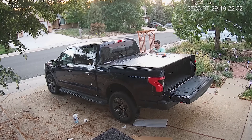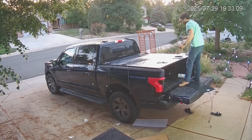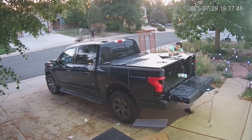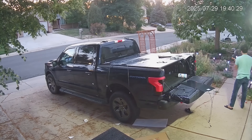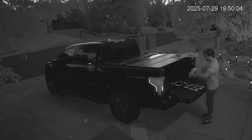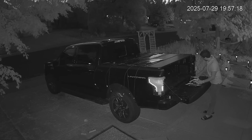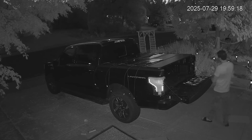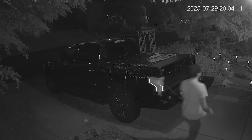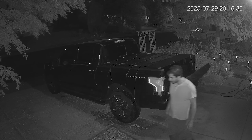Two panels are down, time for the third — and the third panel is on. Unfortunately no matter what I did I couldn't get anything out of the caulk gun for the second tube, so I eventually just cut the tube open and started spackling the glue on the solar panels. This was much easier and I really should have just done this from the beginning. On the sixth panel, the third row of the cover, I ran out of glue, so everything's going to wait till the next day. So far it's looking pretty good. Make sure to clean everything up after you place the panels because you're definitely not going to be able to clean it up the next day.